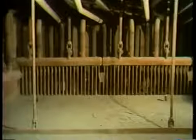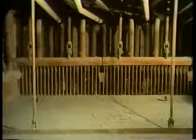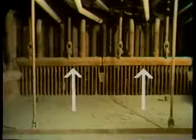Now, let's talk about inspecting dead air space. Dead air spaces are enclosed areas outside the hot gas passages where the headers are located. These headers are your primary concern when inspecting dead air spaces. There are several common problems associated with the headers. We cover 6 of them: support failure, evidence of leakage, corrosion, cracks, problems in areas previously repaired, and problems with construction welds.